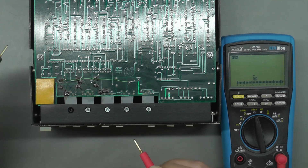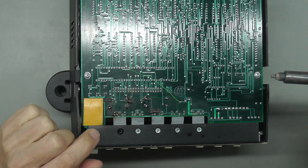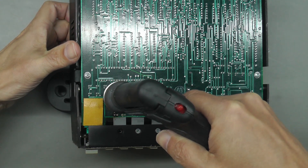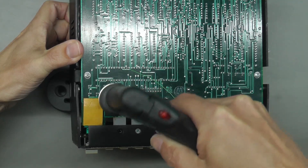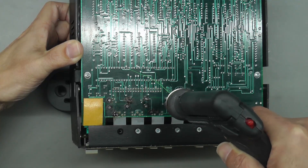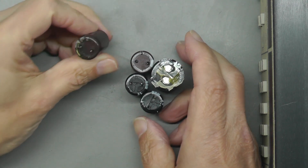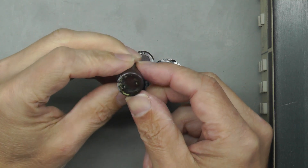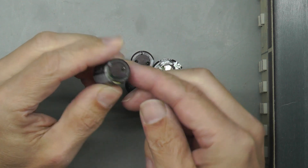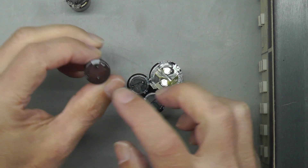None of the regulators are dead short. Let's remove these electrolytic caps — they could have been replaced before, which is maybe why there's flux all over them, but I'm not taking any chances. With the electrolytics removed, this one here is quite bad with gunk oozing out of it, and that other one has definitely been leaking as well — you can see it down through the leg holes.